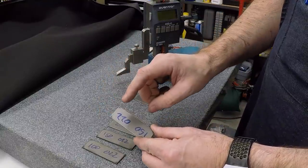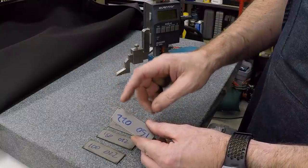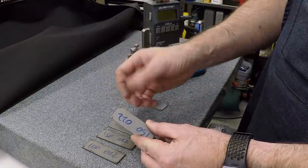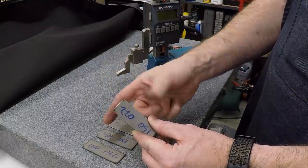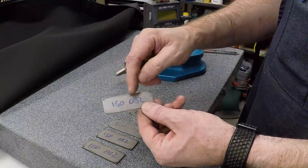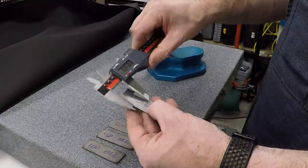And I think I said earlier that if we're 10 thou undersize, it means we need to take 5 thou off of the kerf, or add 5 thou to the kerf, but actually we need to add 5 thou to each side of the kerf. So if this is 10 thou undersize, we need to tell the software that the kerf is wider by 10 thou. So I cut another one telling it that the kerf was 032 at the same 150 inches a minute,